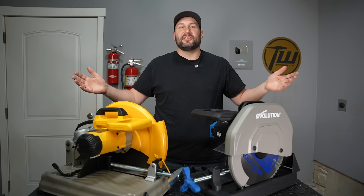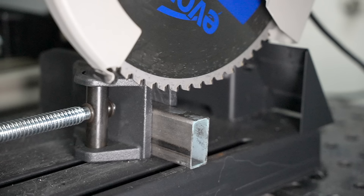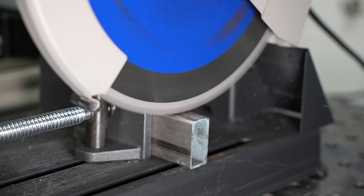This is the type of saw I used in my dad's shop when I was first learning fabrication, and for many years after that, until I upgraded to use one with a carbide tipped blade. Saws like this Evolution that use a TCT or tungsten carbide tipped blade cut through more like a machining operation with each tooth.